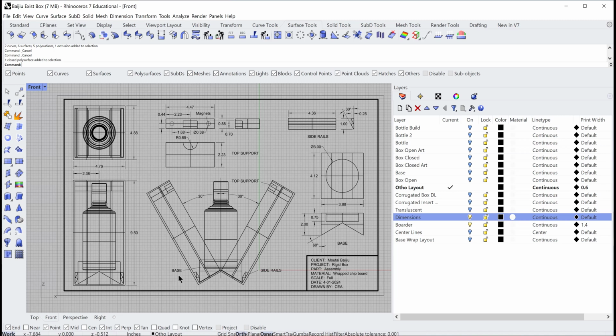And I did this just in line. There's lots of ways to do this. I mean, technically, what should be done is the outline of the object should be in dark line. All internal edges should be in dotted lines. And the dimensions are in an even thinner line. So that's the rules from the very beginning. I kind of modify them once in a while just for expedience sake or what is needed. So it can vary, but something like this is important. Again, we're not doing die lines, we're doing specification drawings, a little bit different. So this is what this looks like.